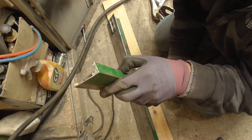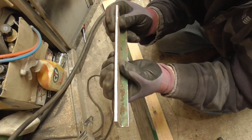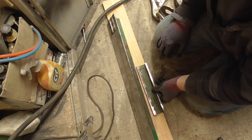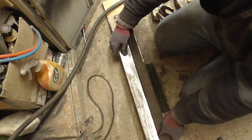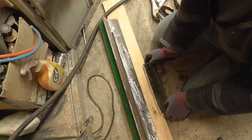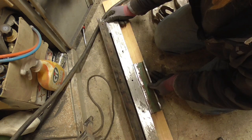I've made a simple bit of steel - a little L-shape - that will clamp into the vise, and hopefully I can just slide it in and it will hold firmly in place. That needs to be attached to the bottom of the sheet bender - so it's currently like that and it will fold up. We need to attach it to this front one here facing backwards, like so.